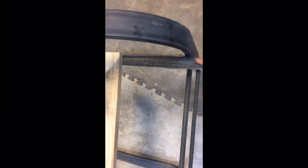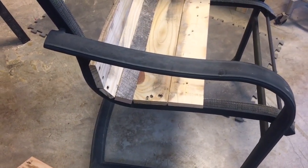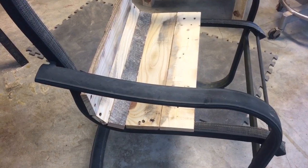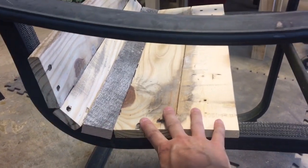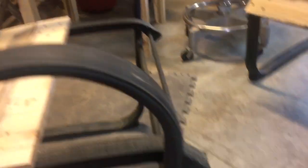The only challenging part is this particular chair has armrests, and these are soldered on so we can't get them off. For the piece that fits there, we're going to have to trim it down just a little bit so it'll fit between the two armrests. I also recommend cutting four pallet wood boards in half right down the middle with a table saw, because the chair has a beautiful curve that's comfortable when you sit on it. If I didn't cut the board in half, it won't have that same nice feel. There's also a curve down at the bottom, so cutting boards in half lets them curve nicely around those edges.